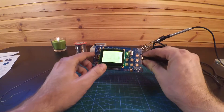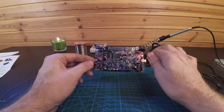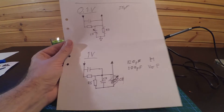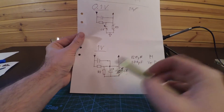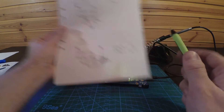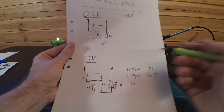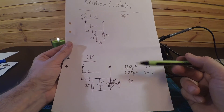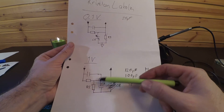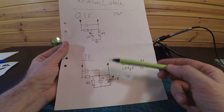I fixed the 1 volt range too. I ended up not using a variable capacitor on C8 — I totally skipped it. C7 I changed from 120 to 100 pF. When I checked the 100 pF with my tester it said 98 pF, but if you're going to do this you have to try yourself and measure the components. If you have problems, buy a bunch of capacitors — you might have some lying around — so you can try different values and end up with a good signal.